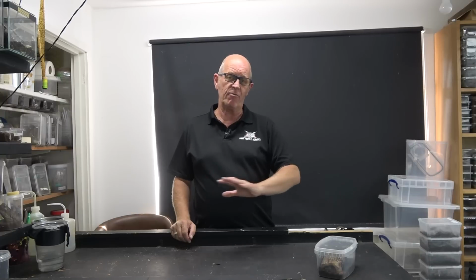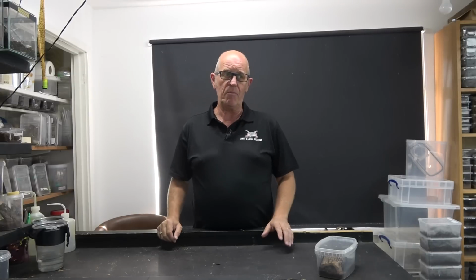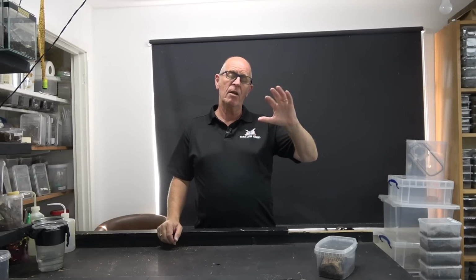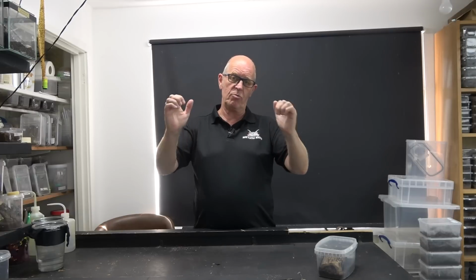Now, it really is a good shout to actually put this rubber down on a hot day, because it softens it out. It makes it really, really soft and pliable. And you would have seen there that Tucker literally opened it all out, got it square, got it round where we needed. He was saying that you need around about 100mm overlap at least on all edges. And this is so that when you put your edge trims in, it all holds it all together.